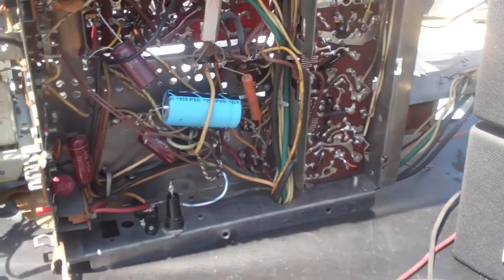I'm putting the camera down. We're all tacked in. Double-check and make sure you've got the negative on the right side or else you'll have an explosion. The other section of this capacitor is 2 µF — that's why you're not getting any bass through it — but we've got good ESR now.